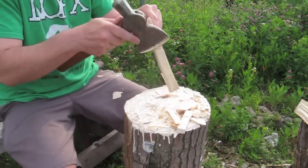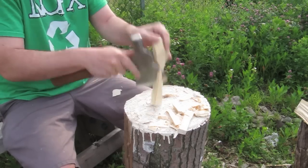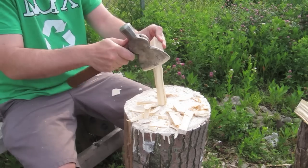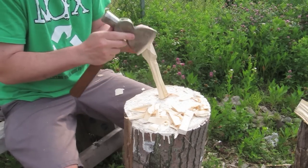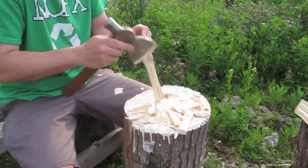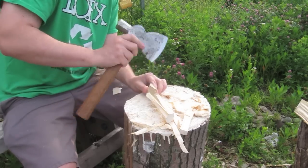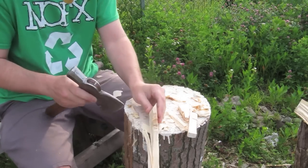Be safe when you're carving. Working with the hatchet takes a long time to get efficient with - I'm not sure I'm there yet myself. I might do a separate video on hatchet carving, including how to get a cheap axe and how you grind it - you want to get as skinny a bevel as possible so it won't bounce off. You could do all this with a knife, but getting the wood down to size from a blank is difficult for a lot of people.